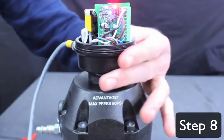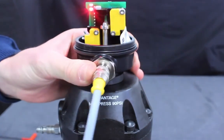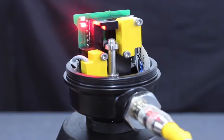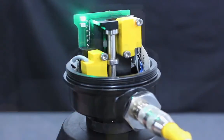Step 8: The switch is currently illuminated red, meaning the valve is cycled closed. Cycle the valve open and the green LED light will illuminate, setting the open switch. Cycle the valve closed and the red LED will illuminate, setting the closed switch.